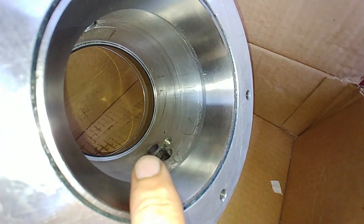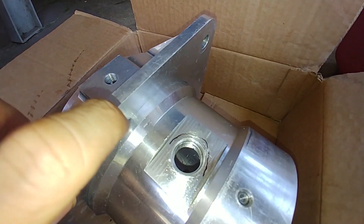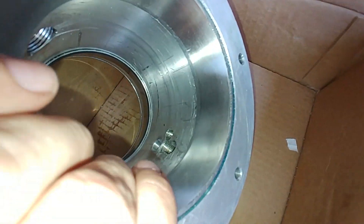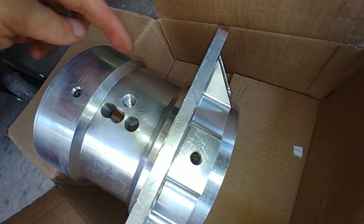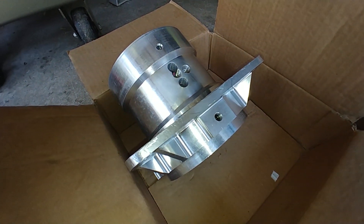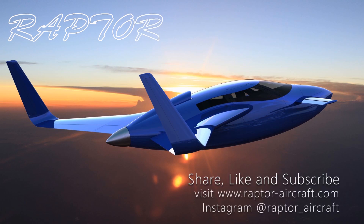On the housing, the oil bath is going to sit in the bottom at that level where I'm pointing. Those holes at the bottom will be blocked up except one which will have a drain plug, and the feed will come in through that old cap plug. There'll be a new drain hole in the side on an angle, about 30 degrees up from the six o'clock mark — right about where I'm pointing. Brit's going to cap those other holes. There's a bunch of stuff to do and it's going to delay things a little bit, but that's the update for the first half of this week. Tune in again on Saturday to see where we get to — thanks for watching.